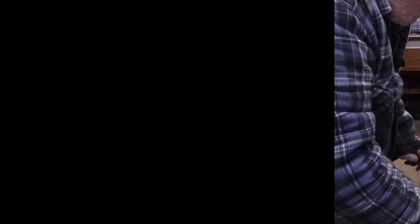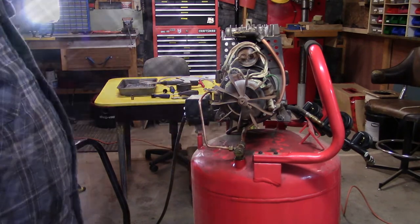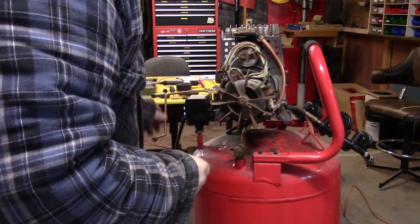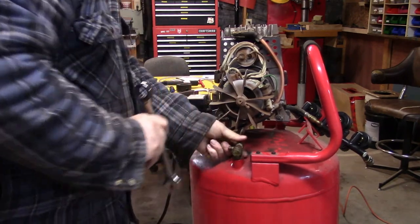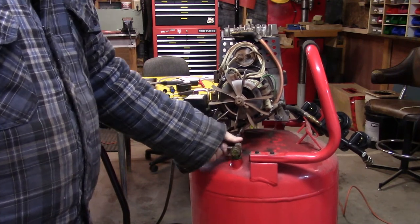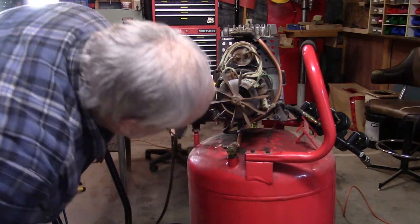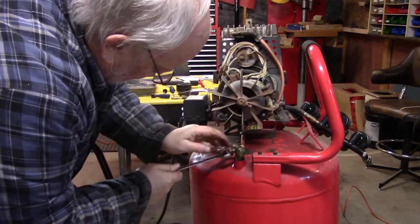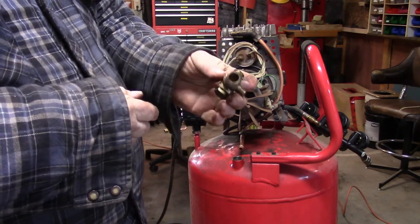Look at that — nothing but lovely. I'm going to let this connection go here, and this one here, and try to take this valve out. That was pretty loose — I don't think that should have been that loose really. This one's loose too — that was super loose. Boy, the guy who owns this compressor sure doesn't take good care of it. I don't want to kink this pipe but I want to get it out of there. I'm going to see if I can get this fitting out of here. This is just a check valve.